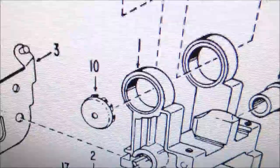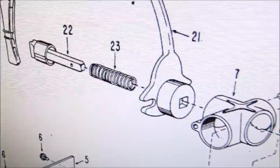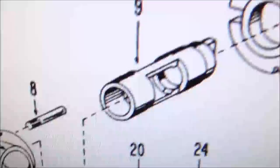Right? So there's the pin that holds it all together. You take that loose and this tailpiece comes off. Remember, we did that kind of last though because it was stuck. The piston and the spring that goes inside pop out. And then you can also take the gripper bow off. So once you do that, there is nothing going through this shaft, which means that that shaft can now come out.